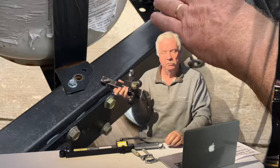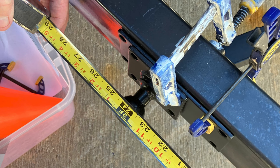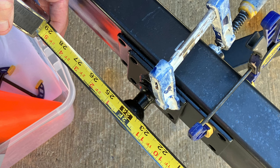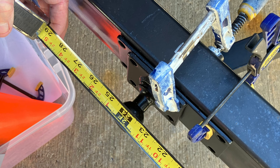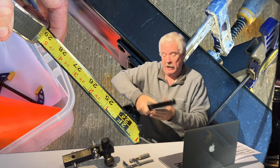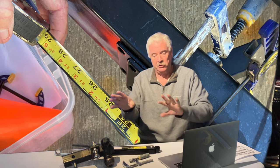The tab needs to be attached to your trailer hitch. I'm a big fan of dry-fitting things together first, so I used clamps to hold all the components in position without welding — just to confirm everything would work. I clamped the ball mount to the trailer tongue 24 inches from the other end, and clamped the tab onto the hitch. Set it all up, tried it out — works great with everything just clamped. That way I knew exactly how to do it before committing.